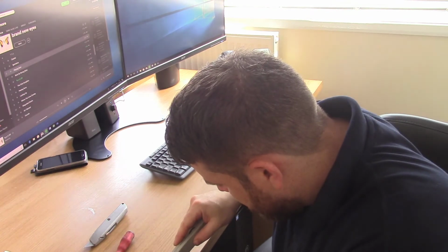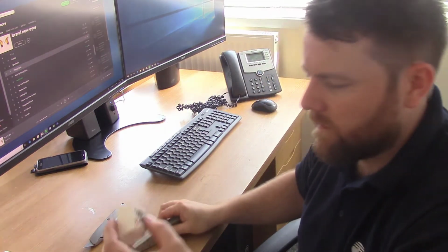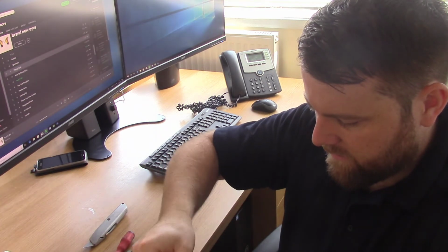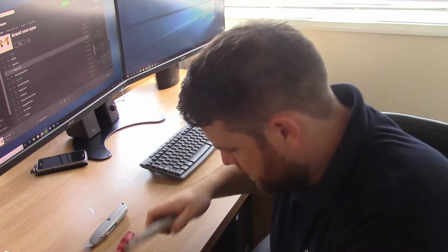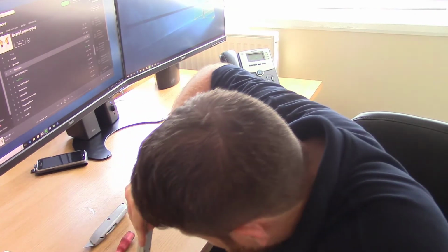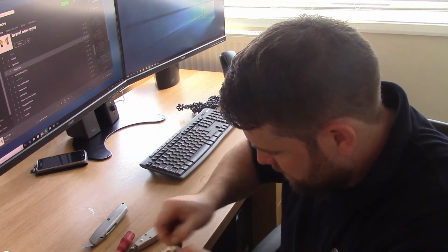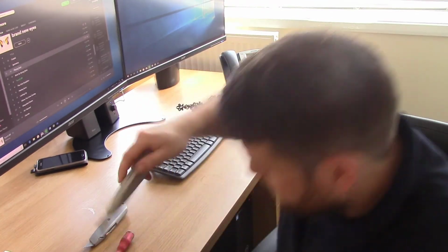So I've got the brown pair in. Punch them down. There goes the brown pair. I'm just going to repeat this process again for the orange and blue pairs. And the last one. Okay, so there we have one completed module, ready to go.